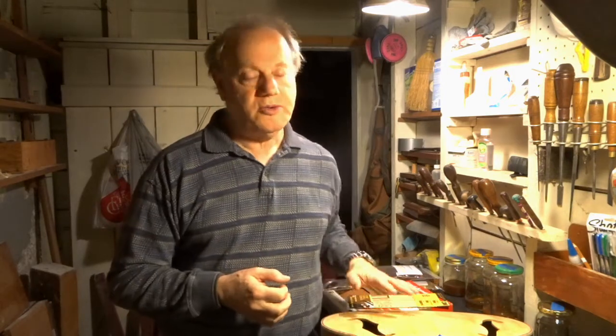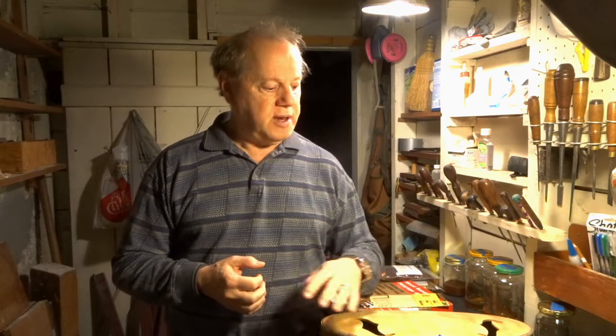One of the things Eugene Clark showed us is to actually sand cross-grain, which seems very counterintuitive. You don't have to do it, but you might want to experiment with that technique. There are a couple of advantages: the sandpaper creates almost a shearing effect and will flatten the surface better than going with the grain. It also creates radial lines that, when you apply the polish, have a really attractive look. So experiment with that after you feel more comfortable.